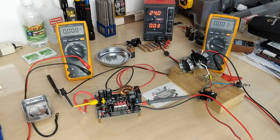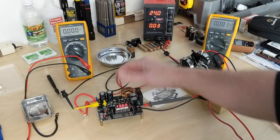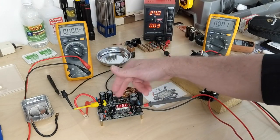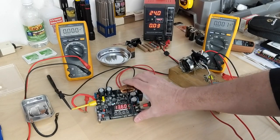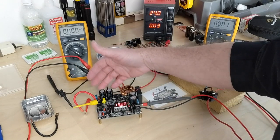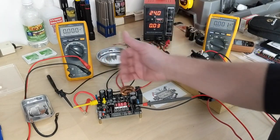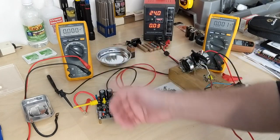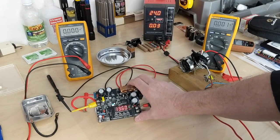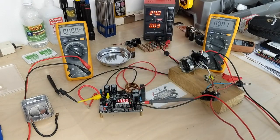So we're pushing about 85 to 86 percent on that one. Overall it looks like this DC-to-DC converter is running between 80 and 86 percent efficiency. Just remember there's always going to be some current to supply the small DC control regulators, converters on board, display drivers, and the CPU. There's also going to be a large inrush current when you first put your battery load onto the caps, so any kind of soft startup — or at least a good relay that can handle the high power input switching — will help. I hope that efficiency information is helpful; if you liked the video give it a thumbs up and please subscribe.